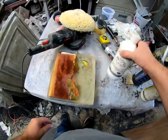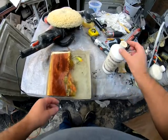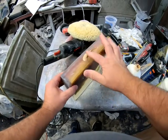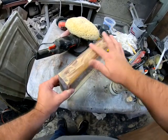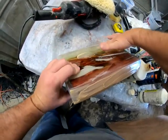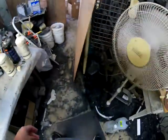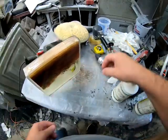I've done one layer of this. I'm going to go around the edges and hit it with it because I've got to polish it up, and the bottom with this same compound. 600 grit. I've got to do them spots there too. 600 grit to 800 grit buffing compound. And I'm going to try to go ahead and put a little some on that. A little bit on this. This is the back side. Okay, this is just one of my edges I want to clean up. Got a little thick. It probably slings stuff all over me. There's my paper towel. Okay, let's see what happens.